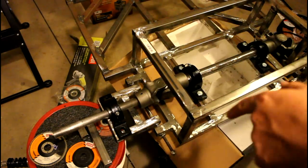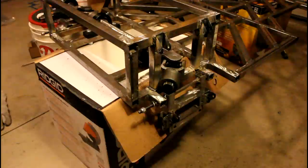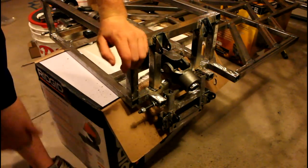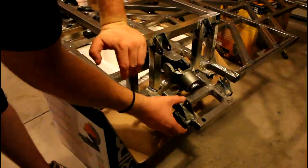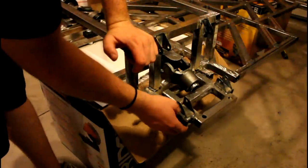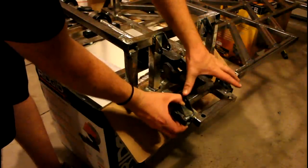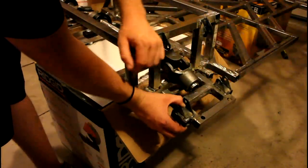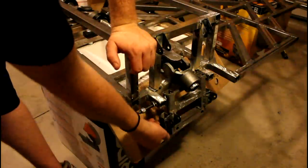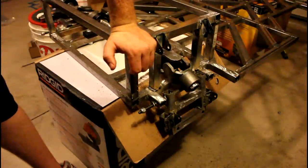That's the first thing I worked on today. Moving on to the last bit — I just finished up the right side of the rear shock setup and still have the left side to do. I've mounted the shock tab here and here on the suspension arm for both shocks. There are two shocks in the back because the axle splits the middle, so I needed two per side for equal force balance. I had to make sure the spacing was correct, then tack welded the tabs into place and did the finishing welds once I confirmed the location was good.